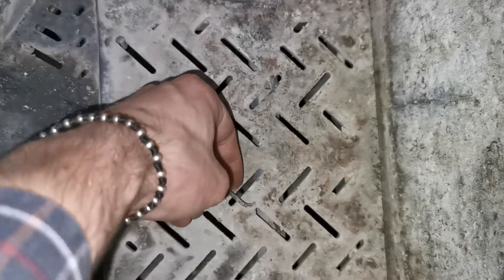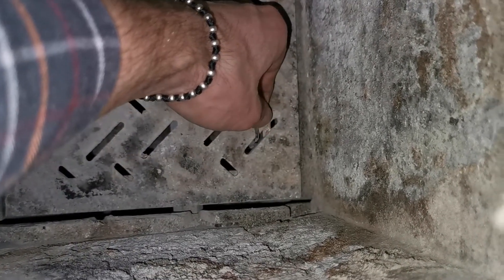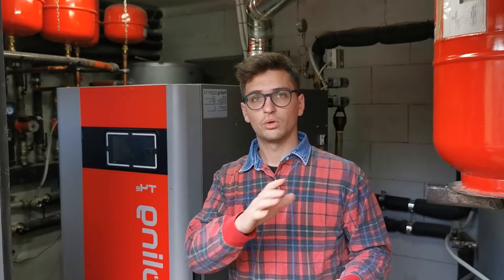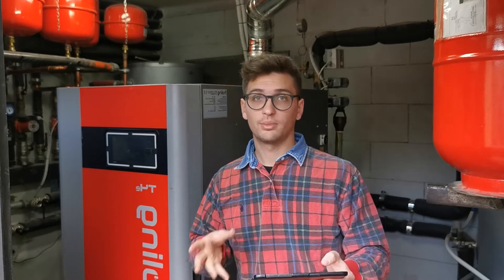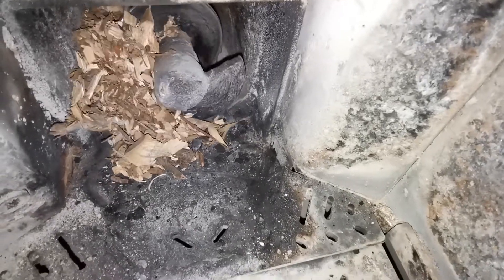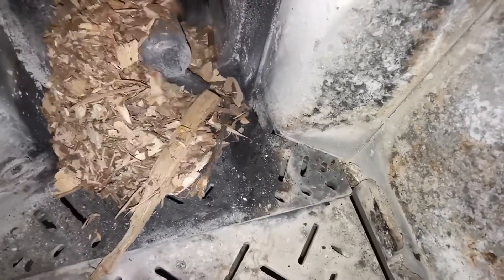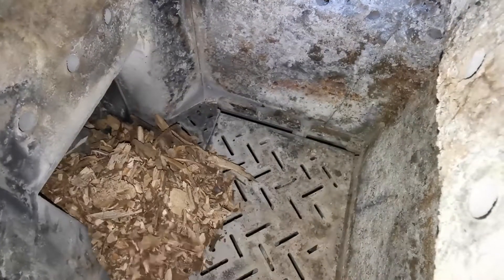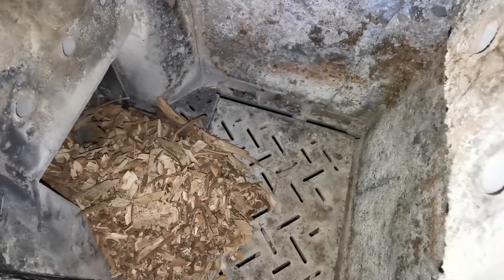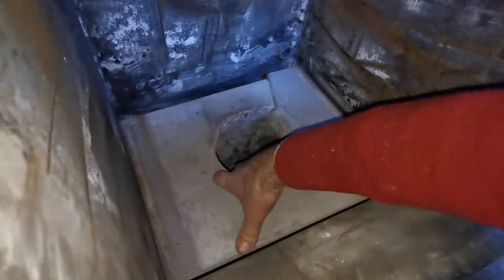Finally, I remove by hand some small nails that are blocked into these slots — I want them as open as possible because air passes through and ashes need to fall down freely without obstacles. At that point the combustion chamber is perfectly clean. The feeding system shows a screw on the left coming from the stoker, bringing material inside the combustion chamber. Once activated, it pushes material into the chamber — very interesting to observe.